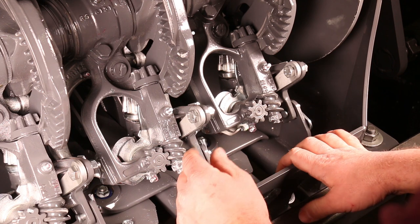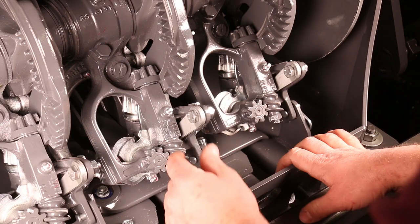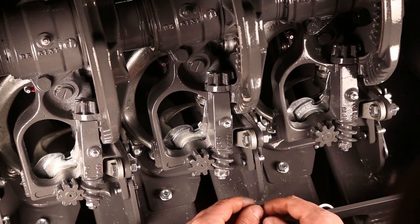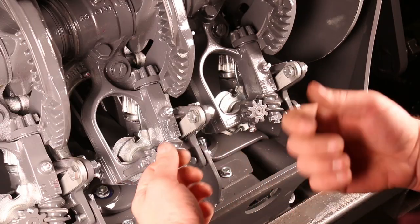Once that's finished, the setting is right. What this dictates is how long the tails will be on the knots. If this is too loose, the tails will be extremely long. If this is too tight, the tails will be extremely short, and if it's way too tight, those knots will actually pull apart after they're tied and you'll get missed ties.